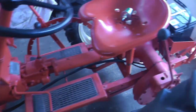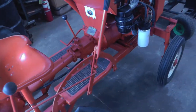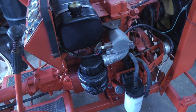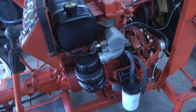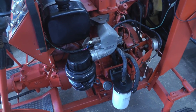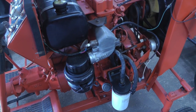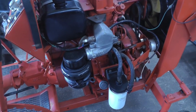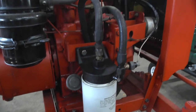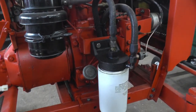The current project on this one: it's just gravity fed now to the injection pump, and I think originally it had an electric fuel pump because it picked fuel up from the tank in the trucks. So I'm going to put an electric fuel pump on it. It seems to run alright but sometimes it just seems like it's starving — just seems weak. So I picked up an electric fuel pump and now I've got to find a place to mount it, which of course needs to be where it's the most congested.